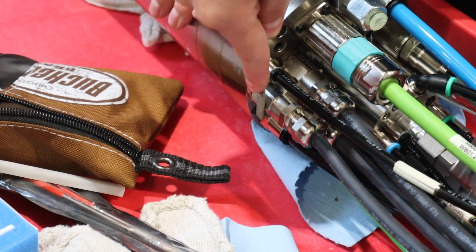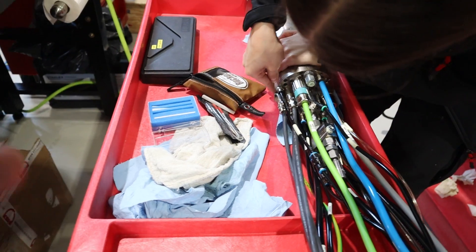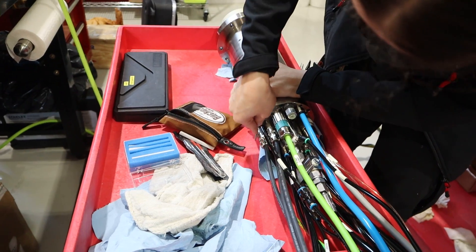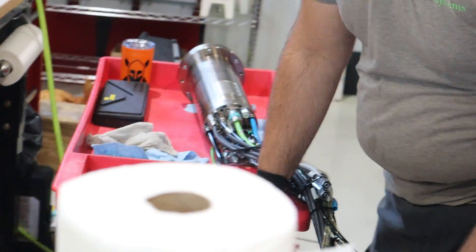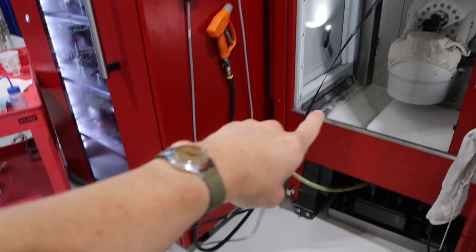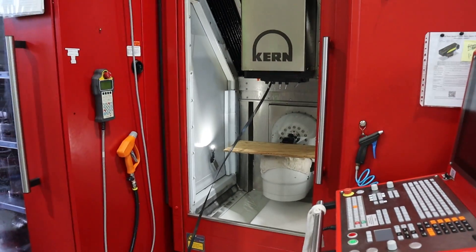She is a professional — I trust her. Apparently, when you put new fittings on the spindle, the hexagonal part of the fitting sticks out past the outside diameter of the spindle, so the corner has to be filed down after it's torqued — otherwise the spindle won't fit into the housing. Just a little bit, not very much. The new spindle has been plumbed up and is ready to go in. It's a very tight fit to get the spindle down and out, and now we've got to go in and up.